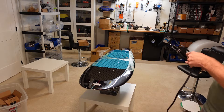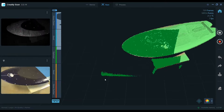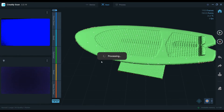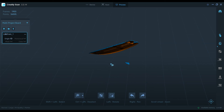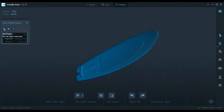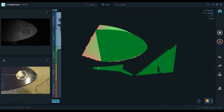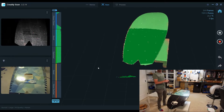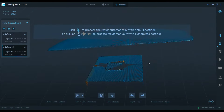I've laid the board down flat and propped it up with a small office garbage can to get a clean scan of one side. After scanning the first side, I stop the scan and the point cloud starts processing. Then I go through and select any erroneous data the scanner picked up and delete it. I just found out that Creality Scan does actually have the capability of taking multiple scans and merging them together, so we're going to give that a try. We'll scan the other side of the board into the project and then see if we can merge them. Back in Creality Scan we select New Project, choose the same settings as the first scan, and scan the other side.